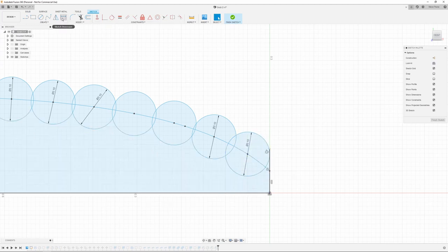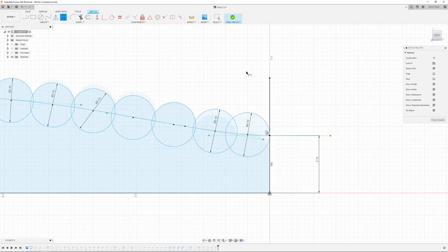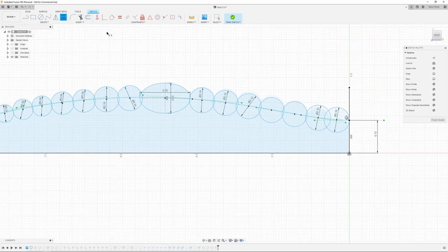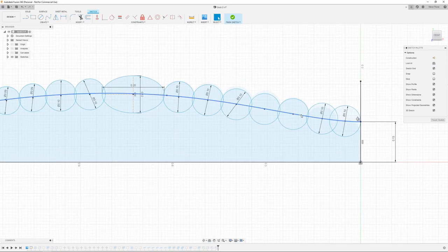And this is causing the denting because it doesn't allow that extra plastic to be drawn in from the runner with the gate being plugged. As you can see, I'm back in CAD. I'm making the front of the bait a little larger. I'm going to make the gate a lot bigger and I'm tapering it in from the runner so it has more opportunity to draw in plastic.